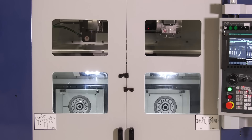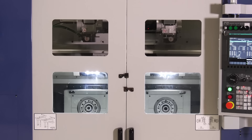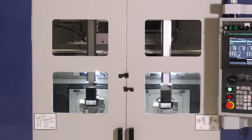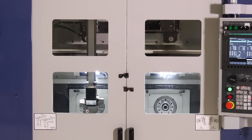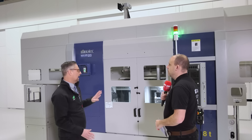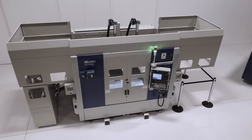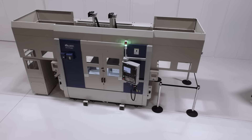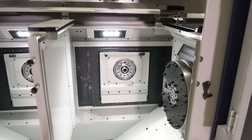Running unmanned and lights-out often comes with challenges that many machinists will know. What does this machine have that can help cater for those long lights-out runs? Obviously you have SPC chutes for either end. You also have the capability of having inspection areas at each side just behind the stocker and on the opposite end, so you can have inspection on OP10 and OP20 and keep that cycle going. Unmanned is the utopia for this situation. You now have the capability to get more tooling in there — sister tool groups, spindle load monitoring, tool load monitoring — so you can basically fill the machine up and walk away.